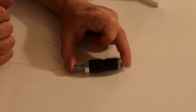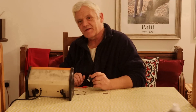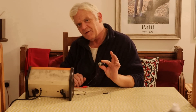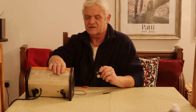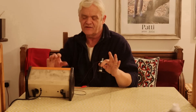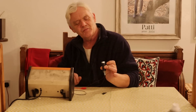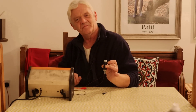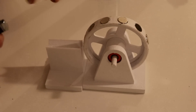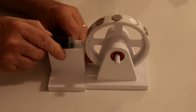Then we're going to need this — it's a solenoid. It's an M10, 70mm long, with copper wire wound around it, but that's exactly what a solenoid is. Solenoids have a very useful property: if I pass a DC current through this — in this case six volts DC — it becomes magnetic until I turn the current off, and then the magnetism fails. That is in fact the basis of any motor.